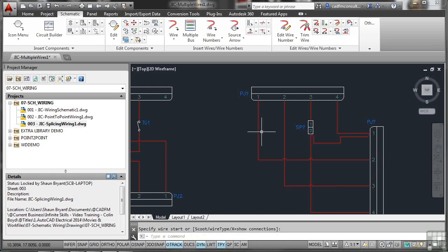You don't have to have connectors — you can put wires into space both horizontally and vertically. Multiple wires is a major time-saving feature; it saves you from drawing regularly spaced wires individually. You can also use snap and grid, but you can specify the horizontal and vertical spacings between wires directly, making the process quick, professional, clean, and most importantly accurate. Make sure you use multiple wires in AutoCAD Electrical.